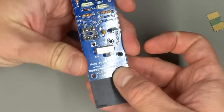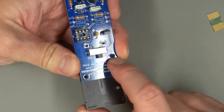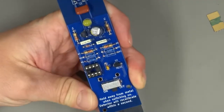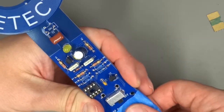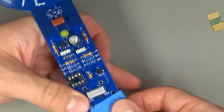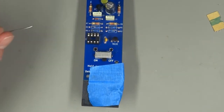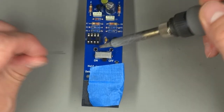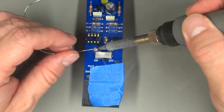Now, these holes on the board are for number two screws. If you have some number two screws, you can use them to hold this in place for soldering. If not, you can just put a big piece of tape around it. I find that the battery holder does hold to the project well enough just with solder, but if you want added stability, you can add those screws. If there were any screws in your kit, consider them an added bonus. A gift from Four Bit Industries.